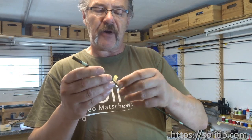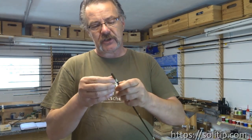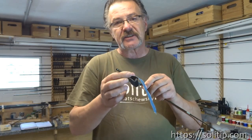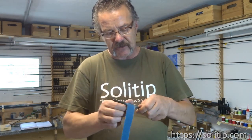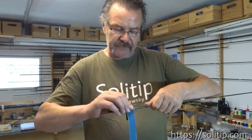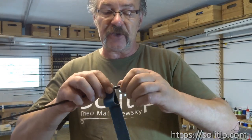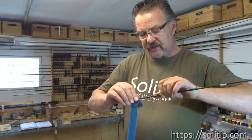So once the epoxy is cured, you can remove the tapes and start finishing the repair. You sand this area with sandpaper just to make a smooth finish, not too deep, just the surface. You can use in the beginning 40 grit sandpaper, and then a little bit finer sandpaper, just to remove the excess of the epoxy, not too deep into the roving or hurt the roving at all, because then you will lose the strength of the material itself. So this is important, just to have a fine surface.